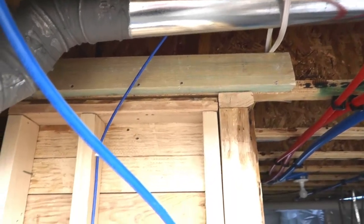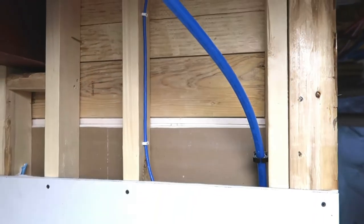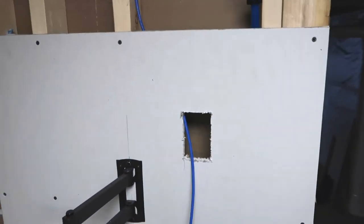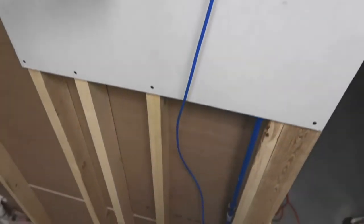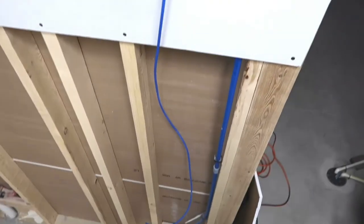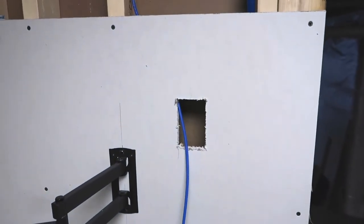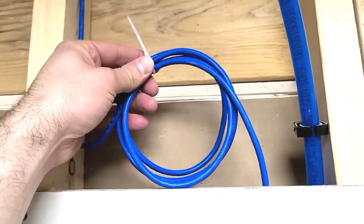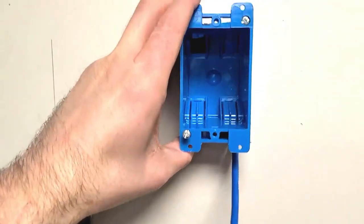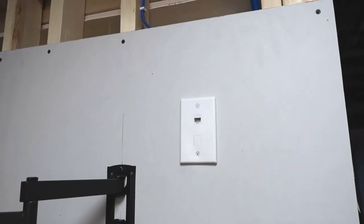The cable is coming across the ceiling — I had plenty of existing holes to run it through. I tacked it a little bit to the stud so it looks nice, and I've left myself plenty of extra cable for a service loop, which I'll coil up and shove inside. In case I ever want to move this box or make changes, it's really nice to have extra. You can see on the light switch there I have a similar loop — you don't have to rerun the entire cable if anything needs to change. We'll pop the box in there and crimp down a connector.